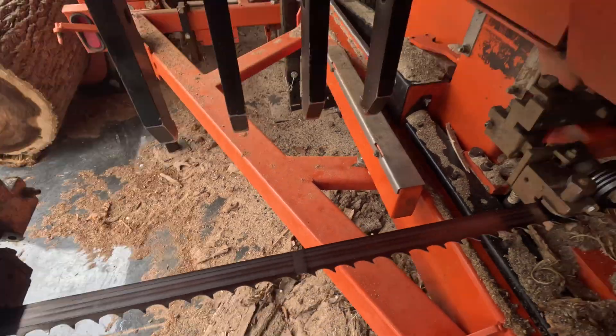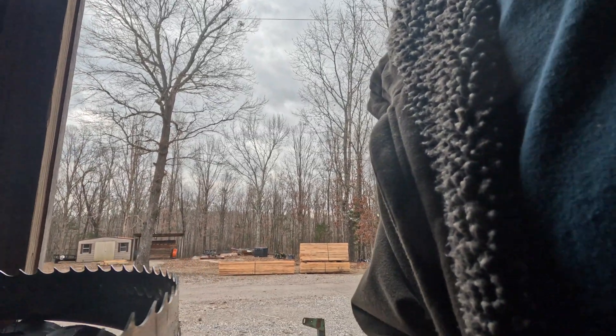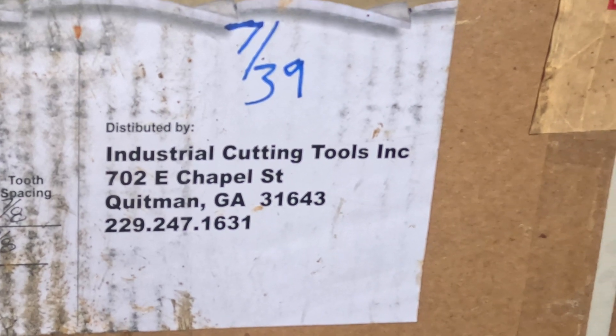So this band gets my Hobby Hardwood sign of approval. Go to your band — the bands you're using — and rub your finger over the weld and see if you can feel it. If it ain't flat, you still may cut flat wood, but it's going to break prematurely. It's going to drive you nuts when you hear it running on the sawmill like an old freight train. It means your band quality could be improved, so call up your manufacturer and bend their ear. I will say it — I don't say it very often — this band is perfect. The guy's name is Joe Main. He works at ICT. He is in Georgia.